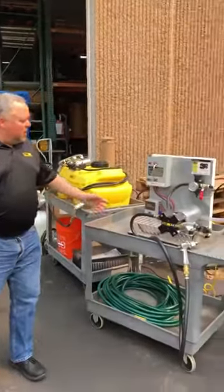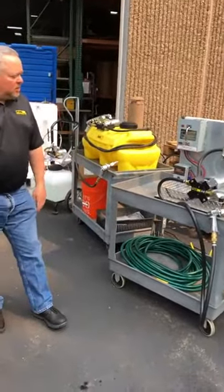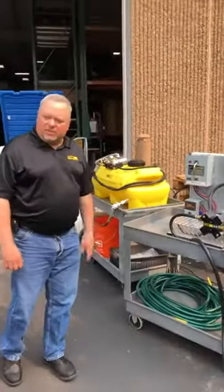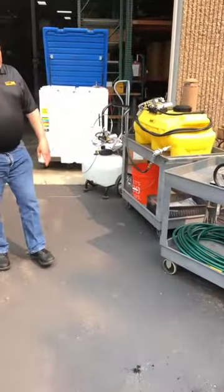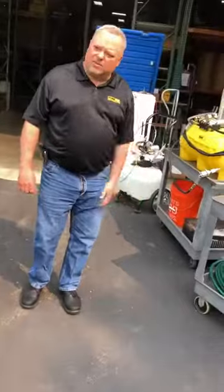And that's available in a DC motor as well? Yes, this is DC — that's why I have a converter on it. This is running off of 50 amp DC. The max flow on this one is six gallons a minute. You have the range from six all the way down to three in the X-Series, and you can change the cams to get different flows too.